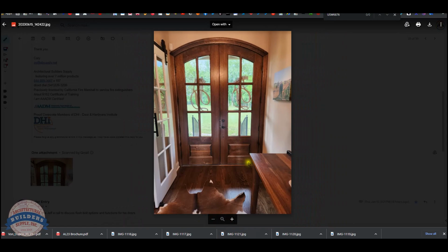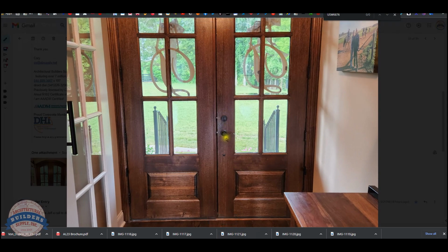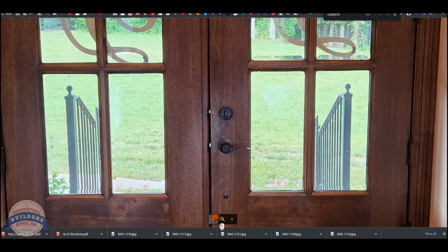Obviously a nice looking entryway, very nice. Clearly a lock and a deadbolt here, or a latch set. It's probably just a passage. So there's only one security device on here. Very likely a grip handle is what's happening. So an entry grip outside, thumb piece always unlocked, with a lever on the inside, as evidenced by this decorative cap here for the bolt that goes through the door.